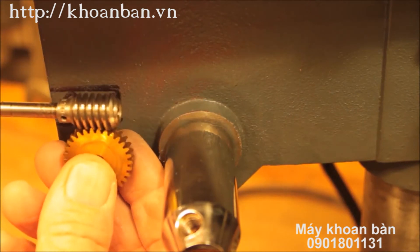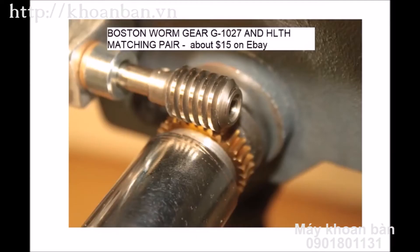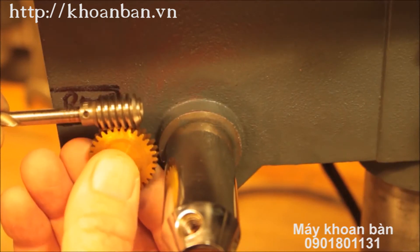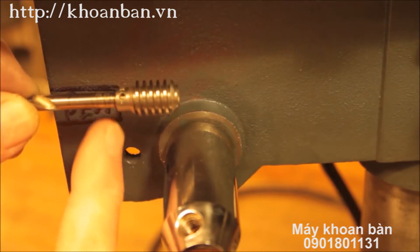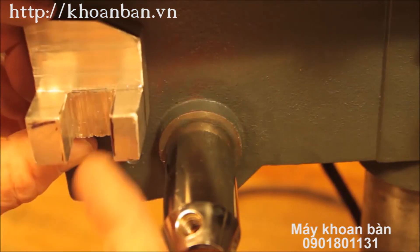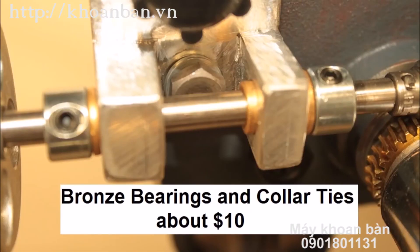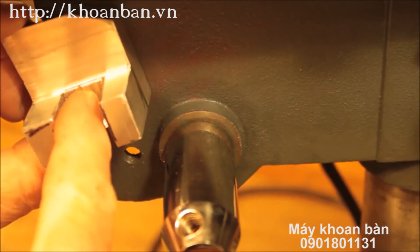The plan for a slow down-motion control is to have a worm and worm wheel here like this. I'll have to mount this where the spindle is, so I'm going to have to move that over a little bit. The worm gear needs some sort of housing, so I'm going to have to make something. I've already got a rough cut piece — this will go through there, have a couple of bearings, the worm gear will go on there. It will have a pivot point right here and will pivot up and down to engage and disengage.